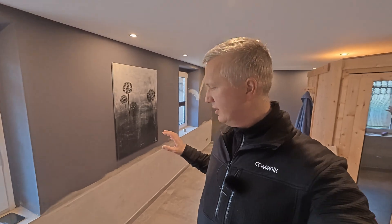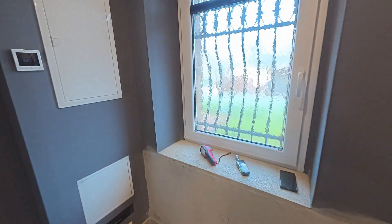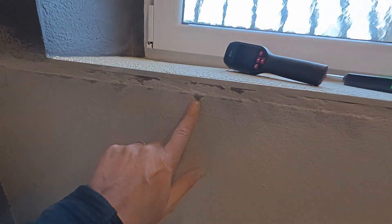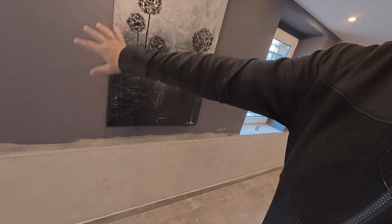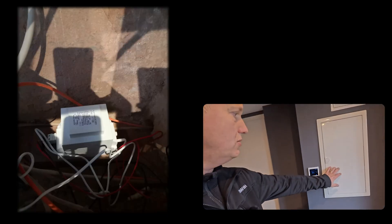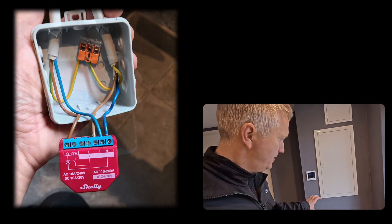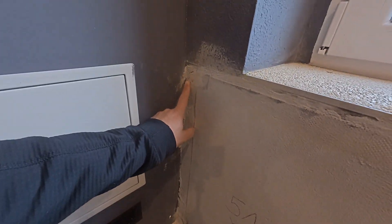The infrared carbon heating film was embedded into the wall. Using a notched trowel we applied the concrete filler, pressed the film into the fresh filler, and smoothed it out again. I then went over the whole thing again to smooth it out. In some places the film is still sticking out, but that's not a problem because the entire room will be treated again. I installed the transformer in the hollow wall — a cable runs directly from the fuse box to the thermostat, from the thermostat the power cable goes into a Shelly, and from the Shelly everything goes to the transformer, which has two cables to supply power to the carbon heating film.